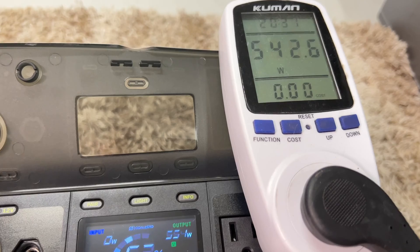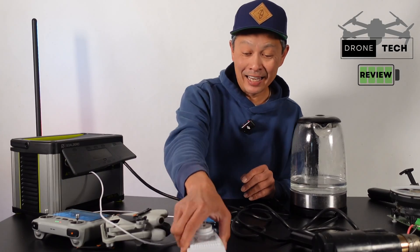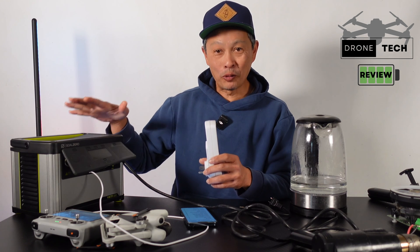For the stress test data, it came out with 411 watt-hours. I measured all the output that came out of it before it shut down — 411Wh out of a rated 500Wh is 82% efficiency, right on par with the norm for these kinds of devices. You have some fan losses and inverter losses.